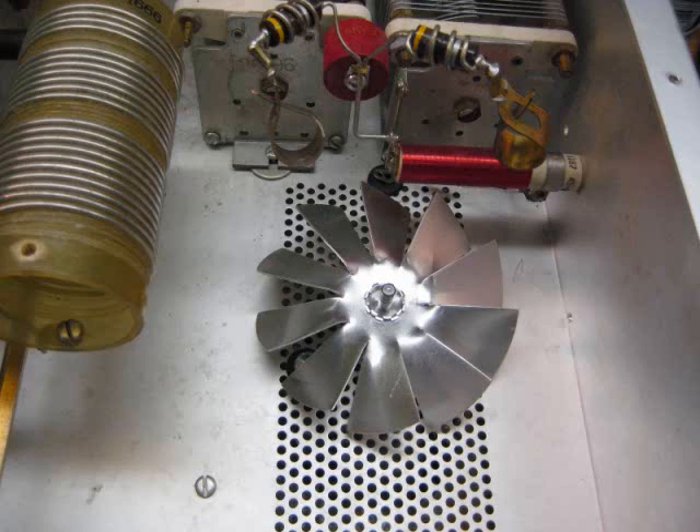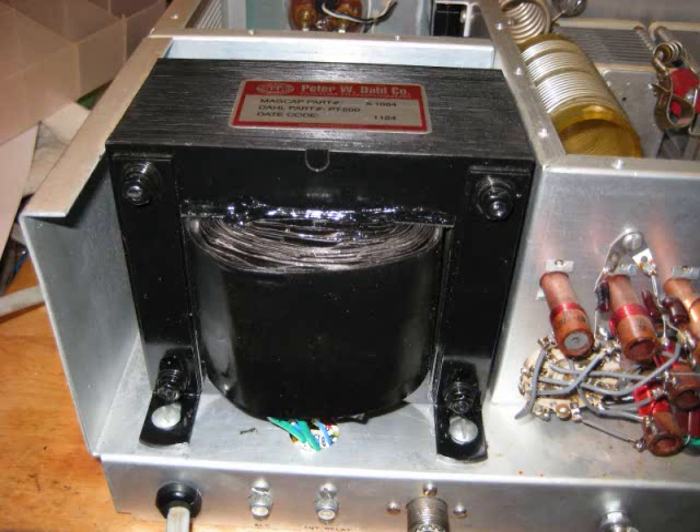There were some issues with the fan motor. There was a suggestion of interfacing with the older wiring, but I felt the wiring was too light, so I just took the existing leads, pulled the original wiring out of the wire bundle, and fished this new wiring through. Here you can see the two locations where it's being installed. There's the fan blade — you have to be careful and bend some things out of the way so you don't short the fan blade to the high voltage lead. But that was not a big problem.